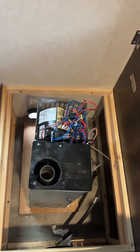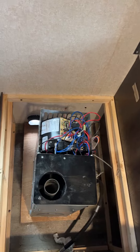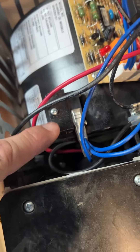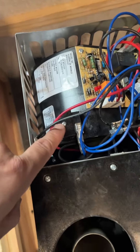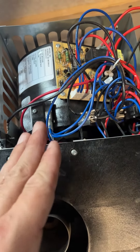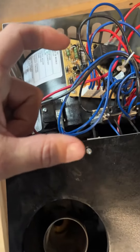From watching a few videos, the sail switch could be dirty. This is the sail switch on this unit right here. You pull that one screw out and then maneuver it up this way and pull it out.